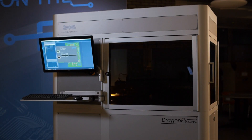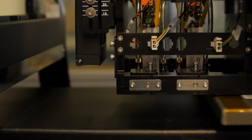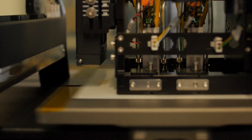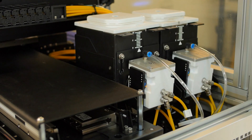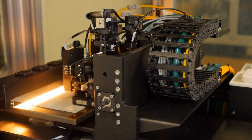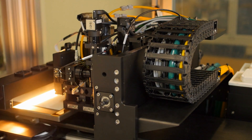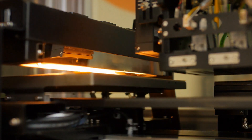The Dragonfly system is an inkjet deposition system — contactless printing, but multi-material contactless printing. This means that on one hand the system is able to deposit polymers and dielectric materials, and on the other hand it's able to deposit conductive material — in our case, silver.